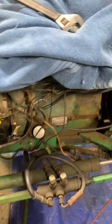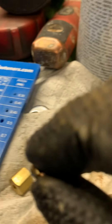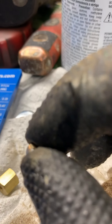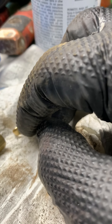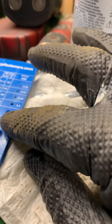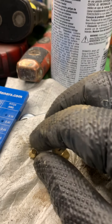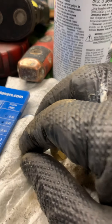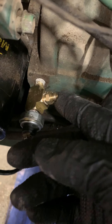Now what I'm going to do is insert this flared fitting. The flare goes towards the fitting, and the broader back end goes onto the plastic tubing. But first you have to put this nut on, so slip this onto the tubing first, then slip this flared fitting — it's a compression fitting — onto the end of the tube. As you tighten them down onto your fitting, that flared fitting going inside will make the compression complete, so there will be no leak.